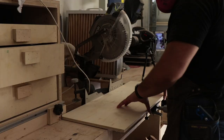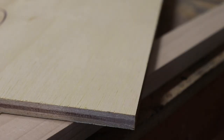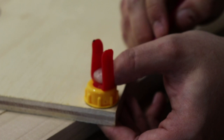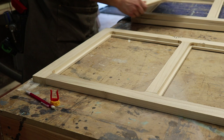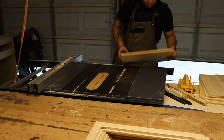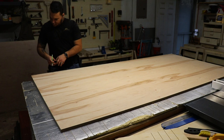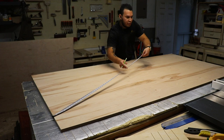I went back to my miter saw and cut all the plywood to rough dimension — trying not to cut my fingers. There are two schools of thought when it comes to fitting things like this: people that square the opening, or people that round the corners of the panel. I decided to round the corners — I think it's easier. After this I went to my table saw with all the panels and started to cut grooves to give an aesthetic appearance to the panels.